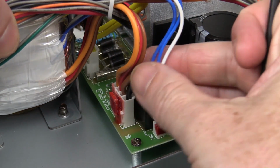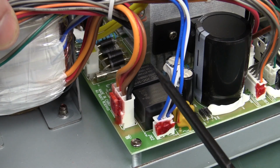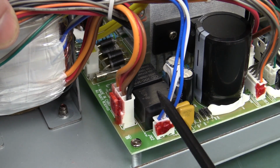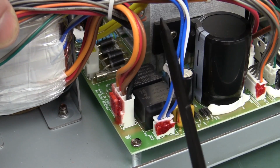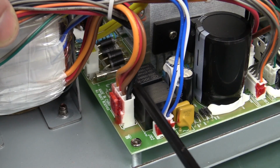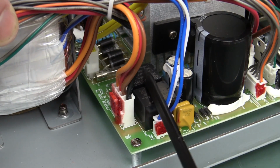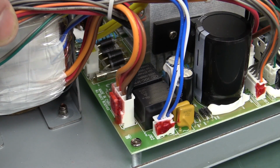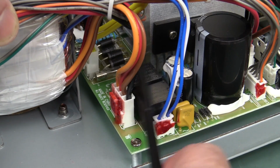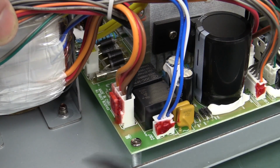And in case you don't know how linear power supplies work, when you've got a 30 volt 3 amp output range, that's a lot of power. If you've got your voltage output set to 1 volt, for example, and you've got a 30 volt input, you've got to drop 30 volts at 3 amps. That's a huge amount of power dissipated in your output power transistor and your heatsink. So depending on the voltage range, they're going to switch in different taps on the transformer. They might have like an 8 volt tap for your low voltage. So if you set your output voltage to 5 volts, it might switch to the 8 volt AC tap, and you don't dissipate nearly as much power in your output power transistor or your heatsink. When you go up to 12 volts output, they might choose a 17 volt tap or something like that. And when you go to the full 30 volts output, they might switch in a 30 volt AC tap or something like that.